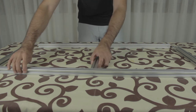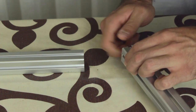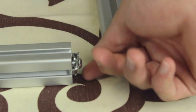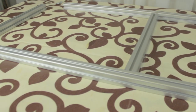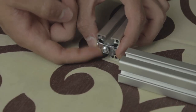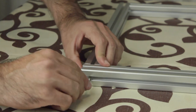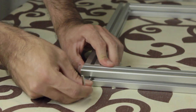As you can see, all the profiles can move since we didn't tighten the bolts yet. I'm going to continue from the corners one by one, installing the fastener in place and sliding it inside the slot. We'll repeat the same process for each corner. Also make sure that the profiles are resting flat on the table before you put any pressure on it, since if you don't, the other unions won't fit properly and the printing surface won't be flat.